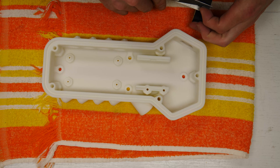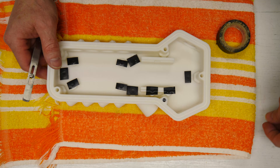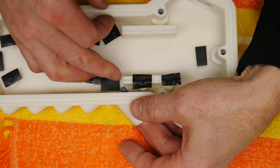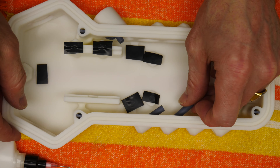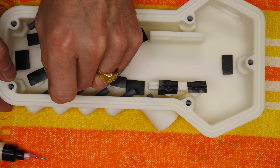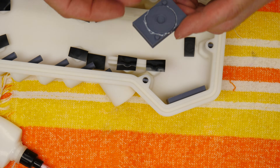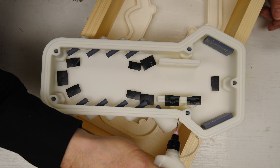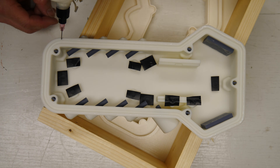The other side is a little more complex — it has a bunch more holes and some pretty deep bosses. Those are 3D-printed parts that go in there to plug up those holes. We put a little white glue on there to get a good seal. The stems on them allow us to get them out afterwards — after the silicone is poured. We'll put a little more white glue around this one as well to seal it to the splitter board for the other half.